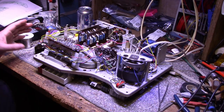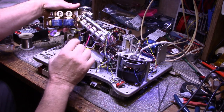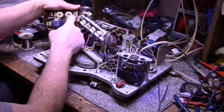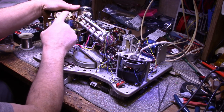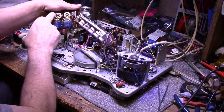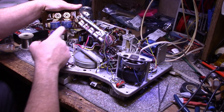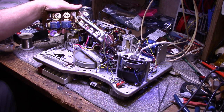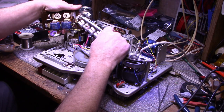Okay, just going through the electronics here. Mostly concerned about the power amplifier board. I did change one capacitor. It's a 0.033, and kind of questionable on the test, but whatever, I changed it. And I test pulled these other caps out and tested them. They're fine. I put them back in. Everything else is good. Some of these resistors aren't the greatest either. They're probably 10% or more out. Especially some of these have gold bands on them, so I might relook at that.